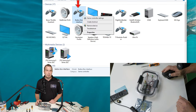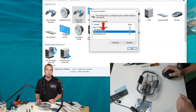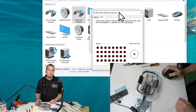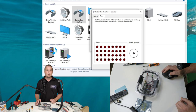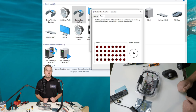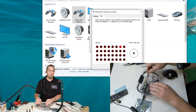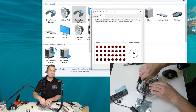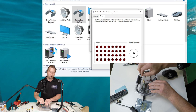So all we're going to need to do is to right-click on the game controller and then go to the game controller settings. Once you have the menu up, we're going to select the button box game controller and then we're going to go to properties. Now that we're in the properties, we can select the test tab at the very top. There's no configuration on this menu that we need to do. I'm simply using the test portion so you can see all the buttons operate. So we'll press in on the encoders. As you can see, the button's lighting up on the screen, our toggle, our push button, and if we turn the encoders left or right, you will see the respective buttons pressing on the screen as well.